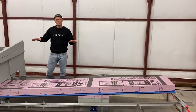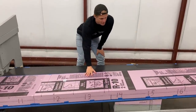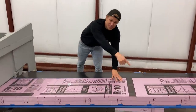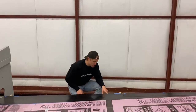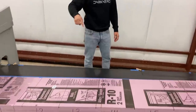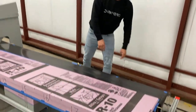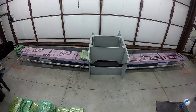The test fixture is all set up and ready to go for the negative G proof load test. We have a load pad set up on the top surface of the wing to give a level surface in the pitch direction for stacking weight. One change from the positive G test is that we labeled all the load stations, which makes it easy to track weight as we stack it. The jacks are in position with machined foam pads for a good interface between jack and wing to distribute load. We also have a frame set up around the wing perimeter with extensometers — rulers clamped on — to track deflection and twist during loading and unloading.